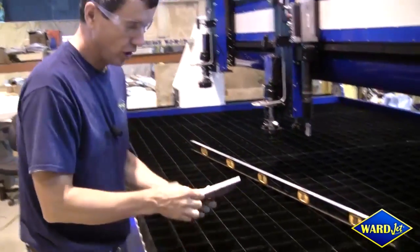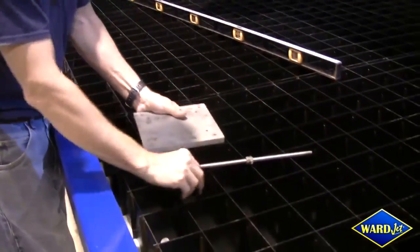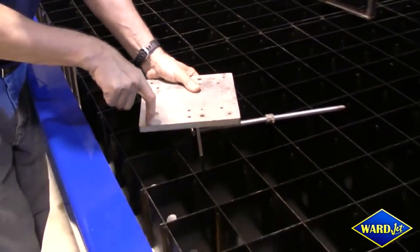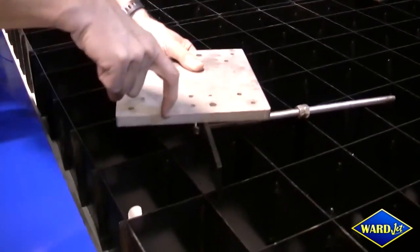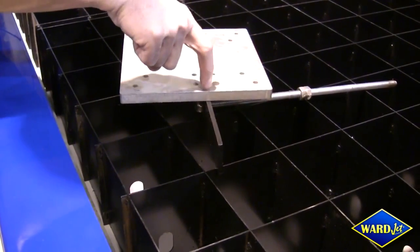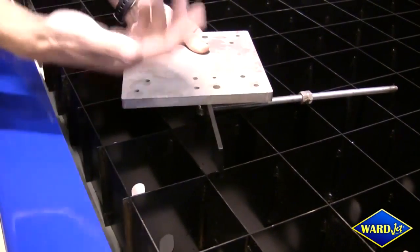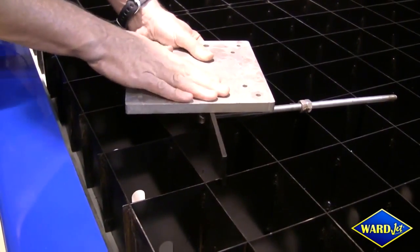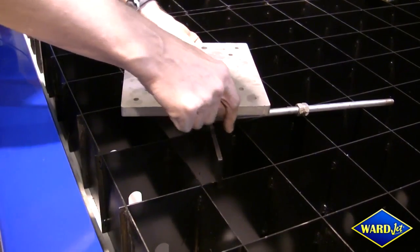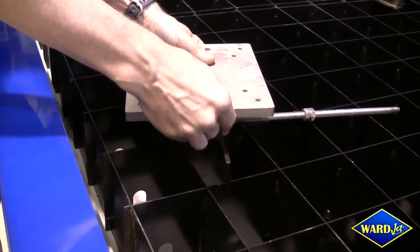Okay. So what people do, if they do have slats, they'll typically go for a thicker piece of material. And if you can imagine, there are a lot of slats underneath here, and I'm coming along with the Waterjet and it's tailing back. When the Waterjet gets to directly above the support, the water is going to go through the material into the support, and because of its width, it thinks it is an extension of what you are cutting, so it cuts deep into that material and then will come out the other side, and as a result you might land up with a very deep cut inside your slat.